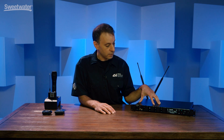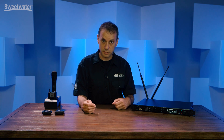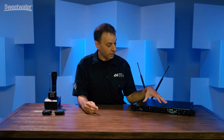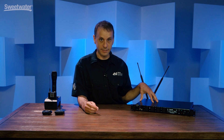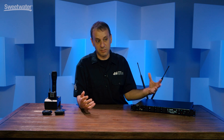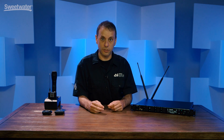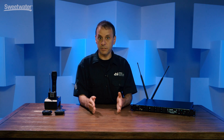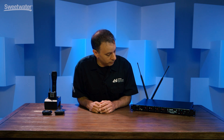It's very efficient and robust in terms of RF performance, with the longest operating range of any of our systems. The quad receiver has a unique feature called Quadversity, which allows you to put four antennas into a single receiver. It turns it into a two-channel device, but with Quadversity you have four streams of information coming into the receiver, giving you coverage in different zones or extending your covered range — and that's available on the quad receivers.